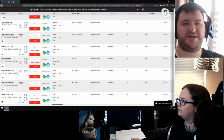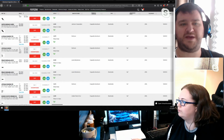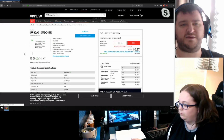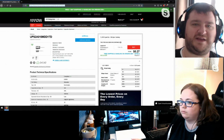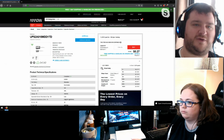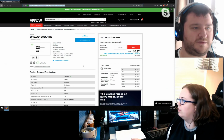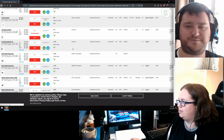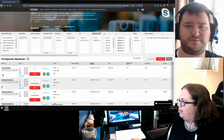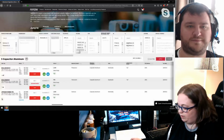Nichicon. Good point. So I have 3 1000 microfarad here, and 3 different voltages, and I'm thinking I'm just going to get 50 volt and use that for all of them to make it easier. That works. Let me see if I could bump up the ones, because there's only a singular 160 volt for the 1 microfarad. So if I go 200, if everything has 200.